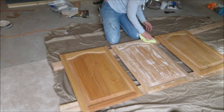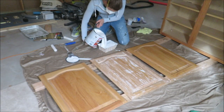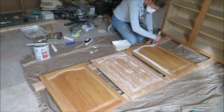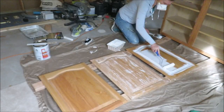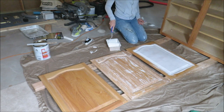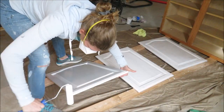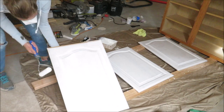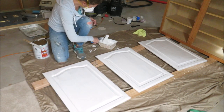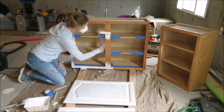Once I was done with my grain filler, I sanded it down again and wiped them clean before priming. The primer I'm using is the BIN primer — it is the shellac base, not the synthetic shellac; make sure you don't get that one by mistake. This is a stain blocker that's great for wood cabinets, especially oak, so you don't get any yellowing and the oak doesn't bleed through your paint. I brushed all the little grooves and then used a small foam roller from Home Depot specifically meant for cabinet painting. The primer was pretty watery so I had to be careful to avoid drips.